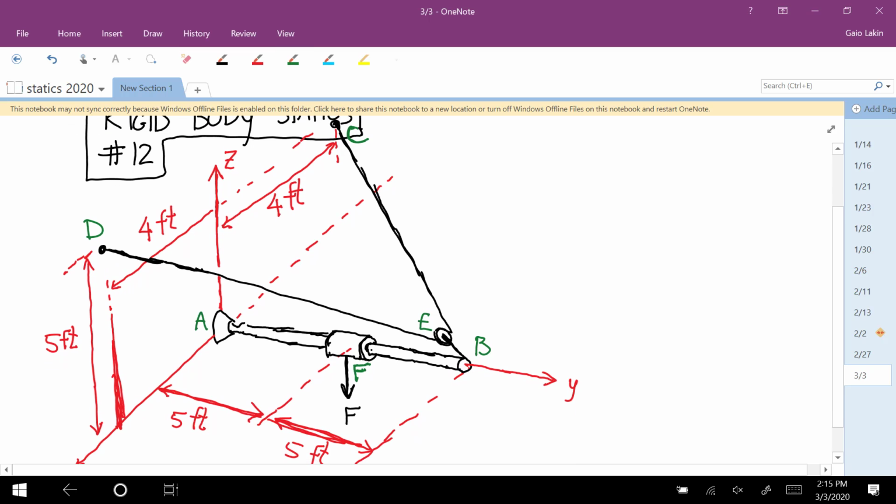And just as an aside, when you're trying to draw pictures like this, the idea is to make it look sort of nice and 3D. The x-axis, the y-axis, and the z-axis all have to be chosen in some direction, and it's not going to be at right angles if you're drawing it out, skewed like this. Once you've chosen those, you just have to think of every line that you draw as being parallel to one of those three.